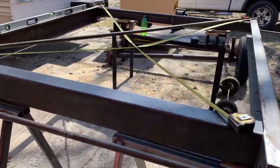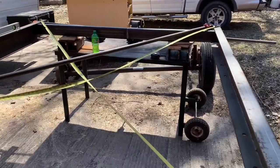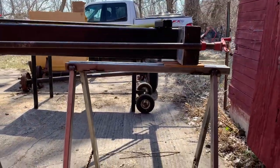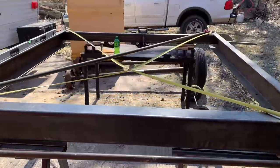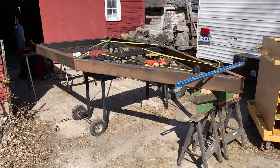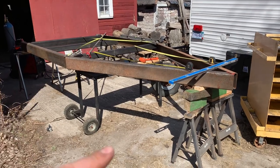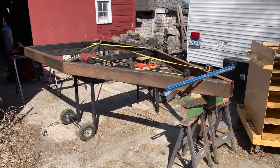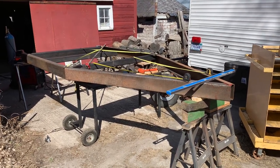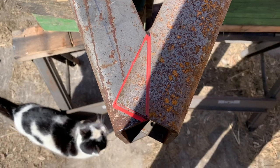I think I got it all squared up. You can see it's windy as can be, so I ended up putting magnets right there and right there. I got it all leveled — it goes by the theory of piss-you-off-itis. You can see the concrete is super unlevel, but measuring diagonals got it pretty square. Got it pretty level and I'll tack her together. There's what it looks like, kind of all laid out. I'm gonna lap these because I think it's gonna be under the trailer and who cares. And then these I got marked so I'm gonna cut them all. You can see how I marked this — just lop it off and weld it all together.